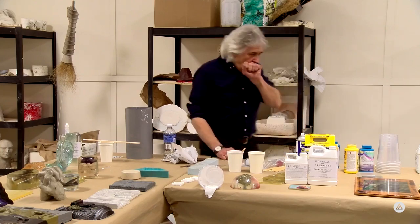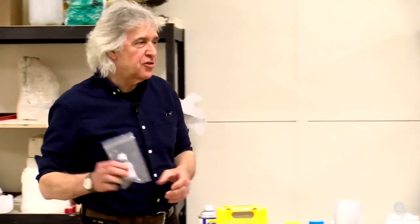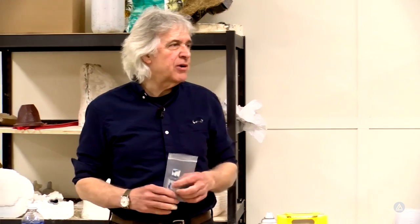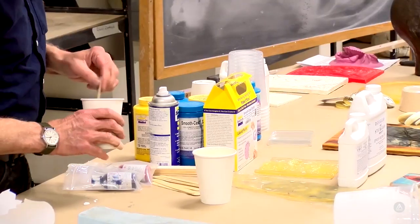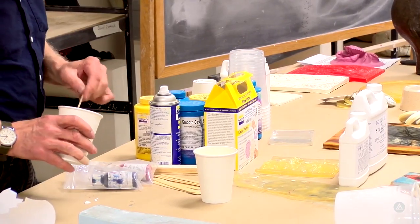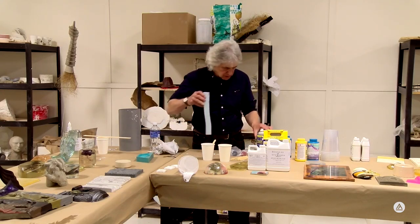Some of these materials will contain chemistries that are more conducive to adding to the part B. And once in a while, if you put it into the part A, not to say it won't go, but certain systems, if you put it in the part A first, it'll kind of form a pre-reaction and it'll upset that whole dance we talked about. That would be an extreme case, but generally speaking with polyurethanes, put the color in the part B. So here we've got something that's in a deep section, it's going to be opaque. Okay, so we'll do that mold, we'll do this mold.